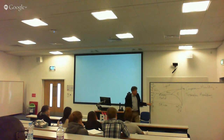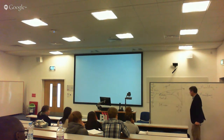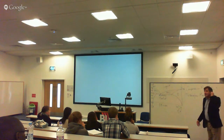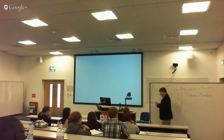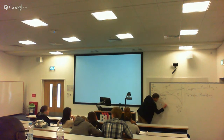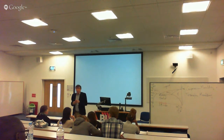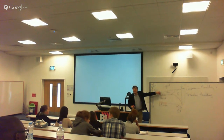If you were to guess, if this is 100% A and this is 100% B, what would this point be? What percentage would it have of A and what percentage of B? Roughly, looking at that. 20, 80? About 80% A, yeah, I think that is good enough. 80% A plus 20% B. Roughly, okay, might be 75-25. Now this means it is the alloy that has the lowest melting point.